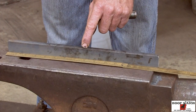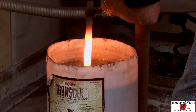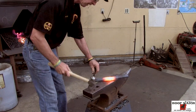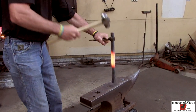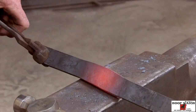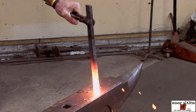So with it being a piece of 1¼ by half, we don't need as much material to draw the clip, and we'll take some of it from the actual safing of the side bone. All right, we're just gonna bump the toe. Now, I'm gonna bump the heel and make us a running wedge on the medial aspect. All right, we'll bump up the heel and we'll run it up as well.